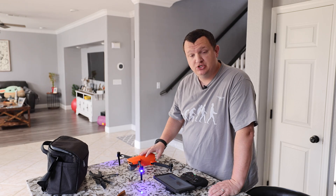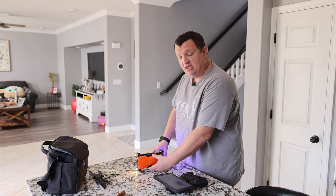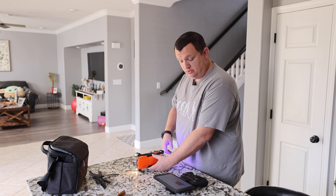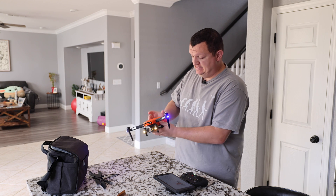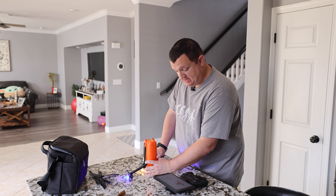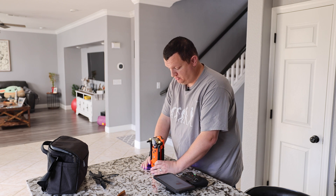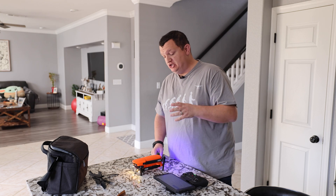It's very pivotal that you do it right out of the cold — right out of that backyard space or garage — and just start it right away. I'm picking the most stable surface I possibly can; I've measured this with a laser level and my island here is incredibly level, so I use that. They're going to want you to open the front legs as shown in the prompt, put the drone straight down on its head, then straight back with arms folded in. And it really is as simple as that — your IMU is completed.